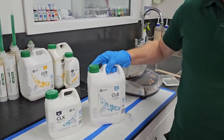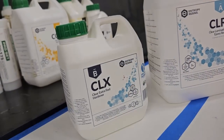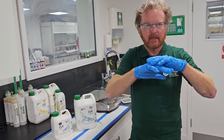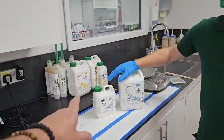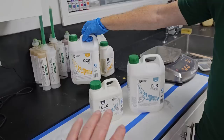Right, so the finish on this has started and it is looking pretty awesome. I want to show you the products we're using because they're similar to the stuff I used — it's all Entropy but slightly different. We're using a surfboard coating epoxy: clear laminating resin and clear laminating extra fast hardener. This is the epoxy used by every surf dude hot-coating a surfboard — it's got brilliant flow characteristics, it's nice and thin, lower viscosity, and it's perfect for coating the table, not for casting. The casting product is for casting; this is a great coating product. So the casting stuff is what the tables are made with, and this is what we use to finish it. Very similar products, but the coating one goes off a bit faster, flows a bit better, and is specifically formulated for that thin film you want from a coating.